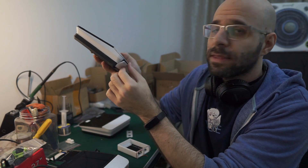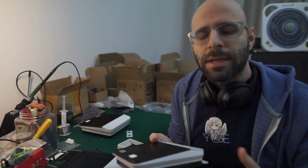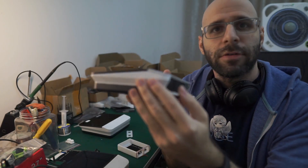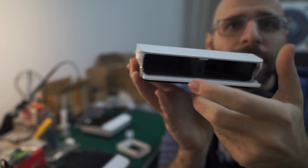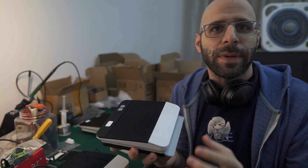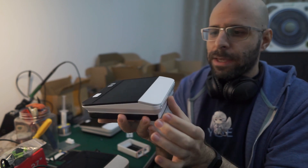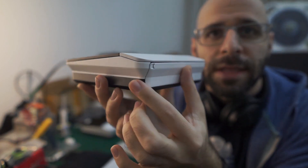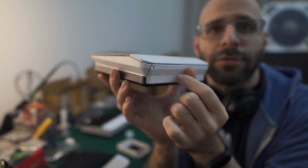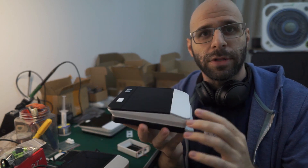In this version we also made this little door. The door is quite nice, but because of the lack of space inside the product, it's very hard to make it strong. In an industrial environment, it's really flimsy and easy to break. When it closes, the colors don't match, which means it has to be a two-color part — that further complicates the assembly and makes the door even weaker. However, one good thing came out of this version, which I'll share in a bit.